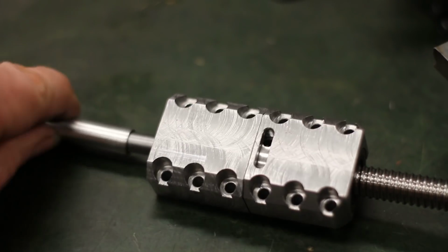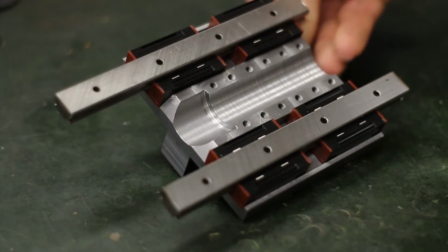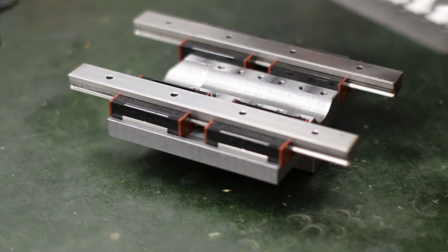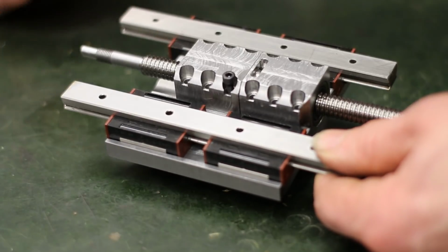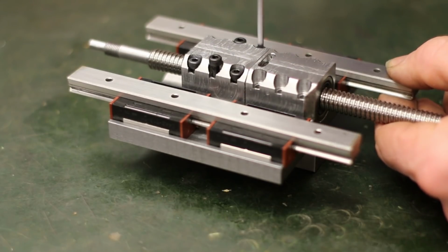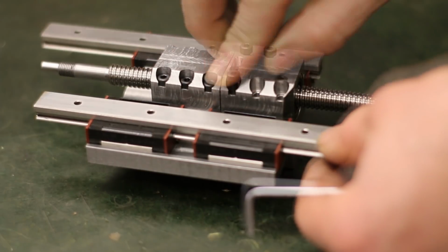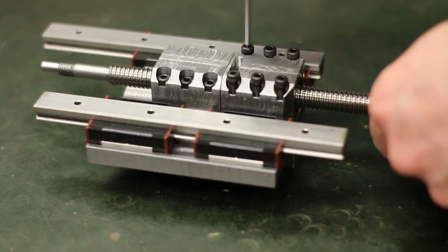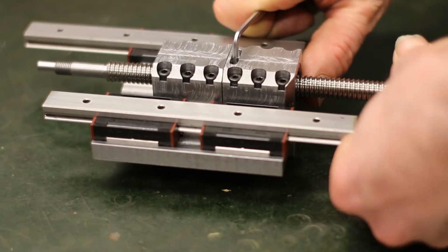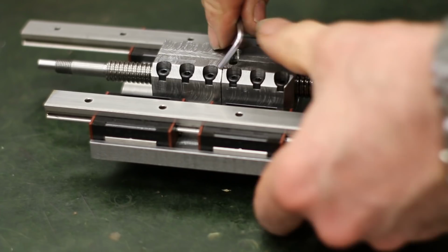Same thing with the other spindle. The linear carriages have pieces of rails for the same purpose, to hold their balls before the final assembly. The fixed spindle nut was first tightened, and then the adjustable spindle mounting screws were put loosely in their places. The backlash adjustment was made by feeling the resistance in the rotation caused by the preload. Then the mounting screws were tightened to the final torque.